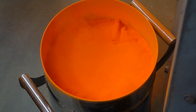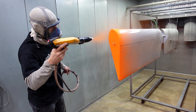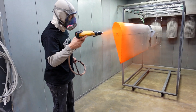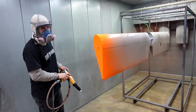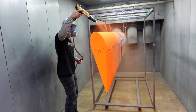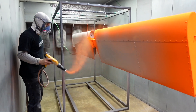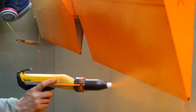On to the primed parts, and here's our final color going on. Again, in these videos it looks like a flat finish and not even the exact color until it gets fully cured in the baking process. The baking process is typically about 15 to 20 minutes at 400 degrees, and it basically turns that powder into a nice candy coat, nice clear coat, and gives an amazing finish which you'll see towards the end.